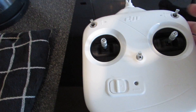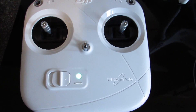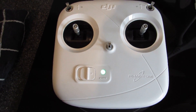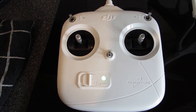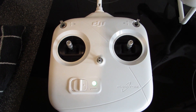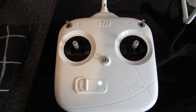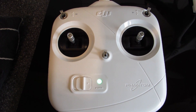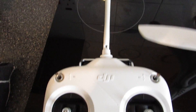You can see straight away what mode it's in when you turn on the control — two beeps means it's in FCC mode. Just to recap: CE mode is a 300 meter range limit, and FCC mode is around 500 meters. You usually do get better ranges than this, but those are the advertised settings. To turn the power up on the transmitter, that's what you need to do. You can also do this in the software, but this is an easy way for someone to do it without having access to the software.